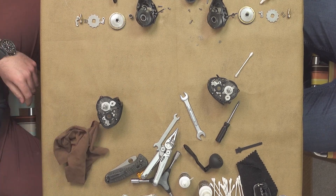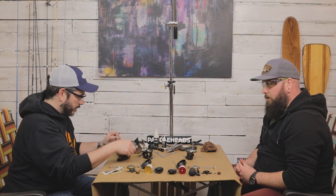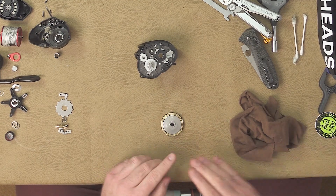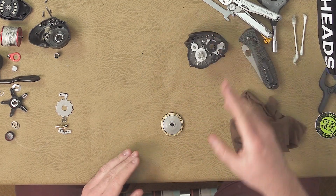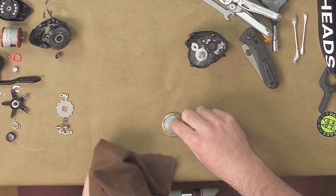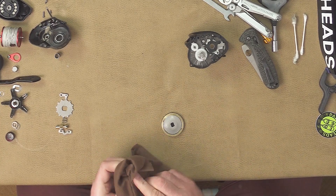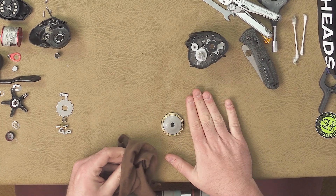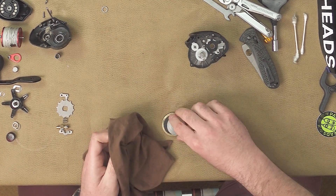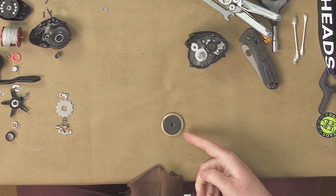And that's it — it's fully disassembled now, as far as we're going to take it for maintenance. Actually, the main gear here in your drag system — this needs to be pulled apart. I recommend doing it separately just because there are so many little pieces. We're going to remove them in the order that they go back on. Take note of which of these discs have grease on them and which don't — it'll be important when you put it back.